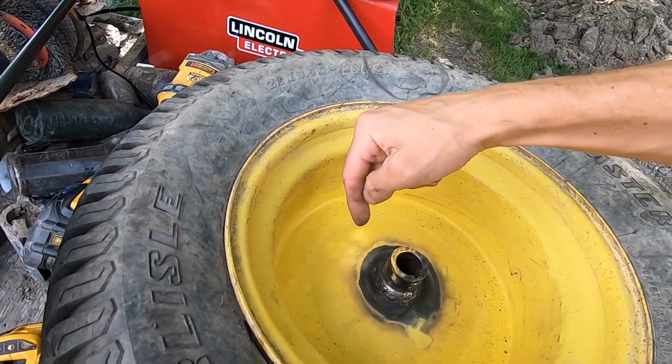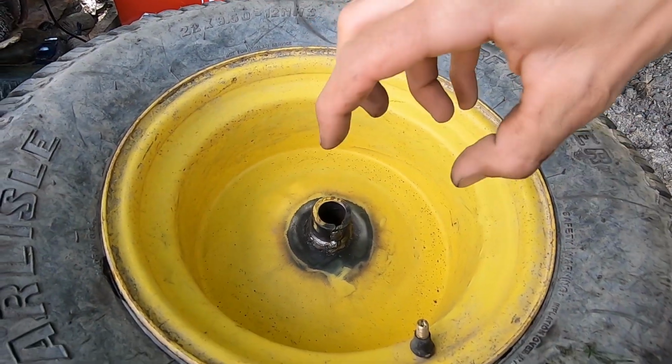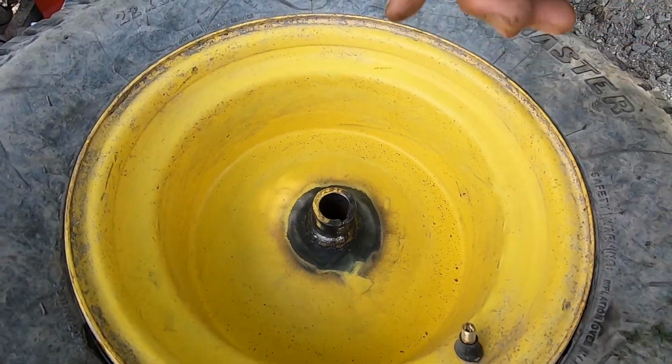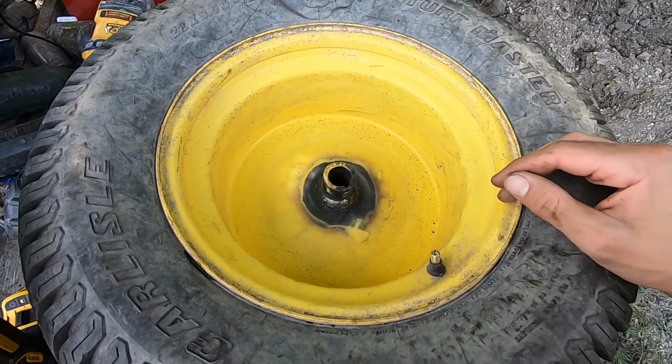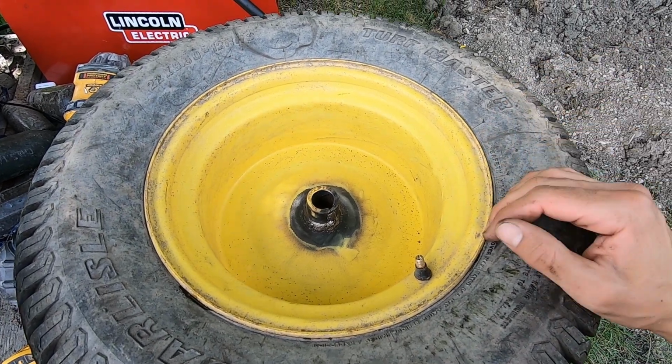All right, well, I got it welded up to the best of my ability. I ended up doing a pretty good sized bead all the way around the hub, and I went up splitting the line. I had everything pinched with the vice grips at the same time, so now I'm just going to take my file and make sure that keyway has no debris in it, get it painted, and I think it's going to go back on the machine,